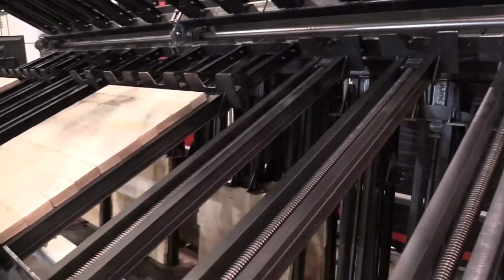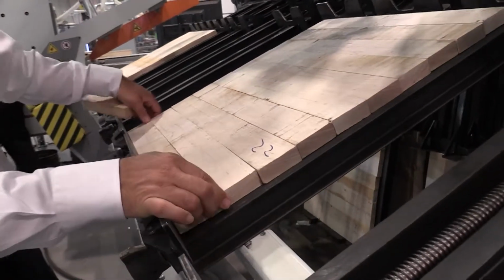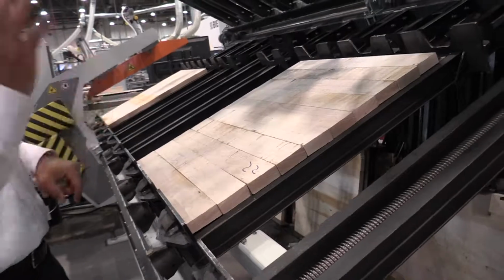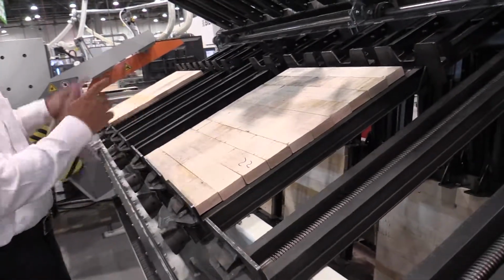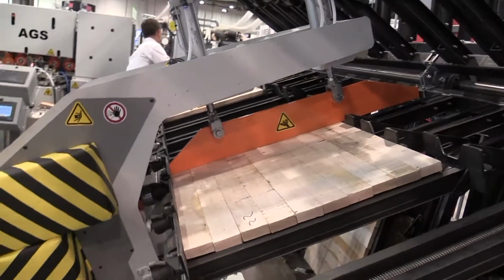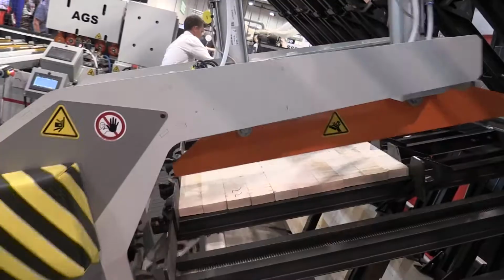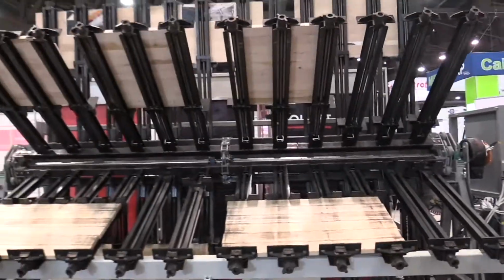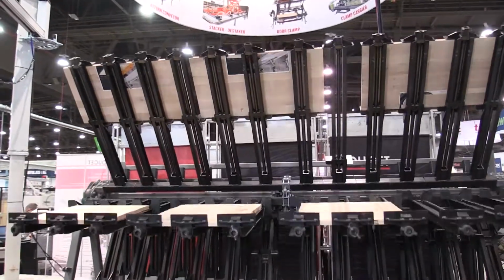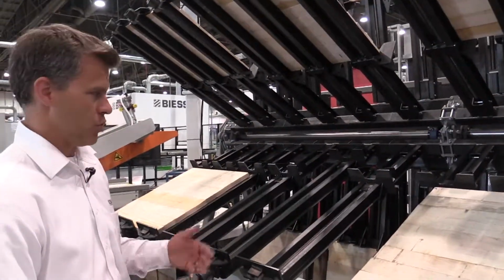So like here, the operator's instruction is always to cover the hole on the clamp. When that hole is covered, that means it's going to be tightened by the robo tightener. And also we have a wider jaw clamp versus a typical 5 inches. Now we have an 8 inch wide jaw. And that's why we can have fewer clamps even if they are fixed. Some users have told us they gain 25% more throughput having the fixed clamp version of their clamp carrier.